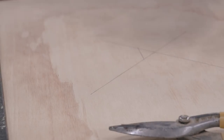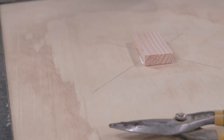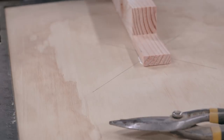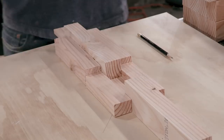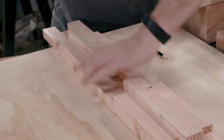The rest of the assembly is pretty self-explanatory — you're basically just building a puzzle. You'll want to check every now and then to make sure your current row is straight, squeeze them together to do the alignment right, and make sure you use just a little dab of construction adhesive so you don't get squeeze-out. That squeeze-out is not easy to get off. From there, I'll leave you to this montage of putting the rest of it together.